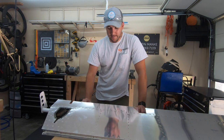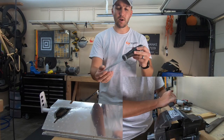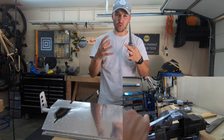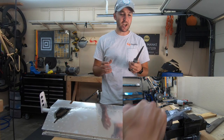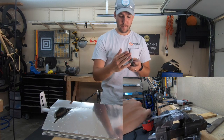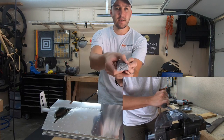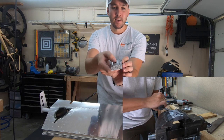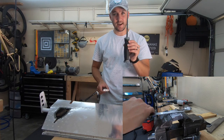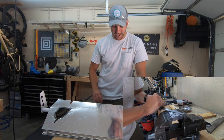What he recommended was using a drywall cutter or something similar — a real aggressive tooth where it's going to actually push material out of the way, grab material and get rid of it, shed it versus clog up and develop heat. This works really well for getting rid of this higher lip here, which is one of the more difficult parts to do.